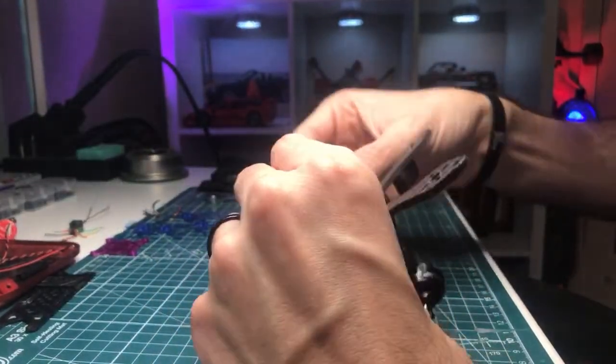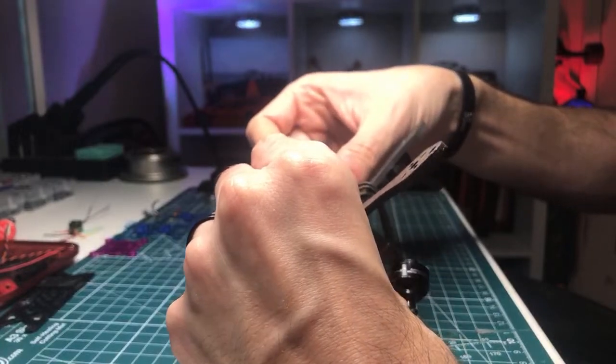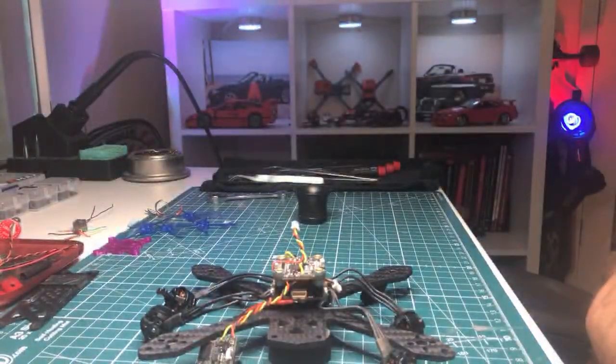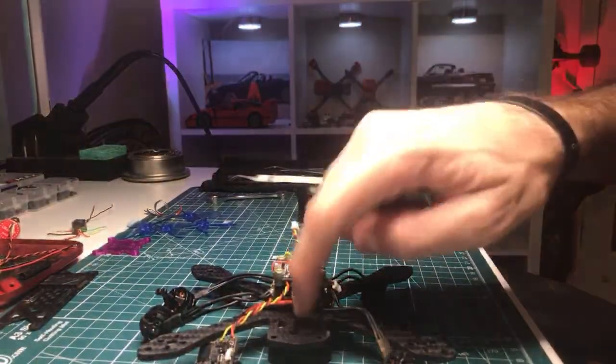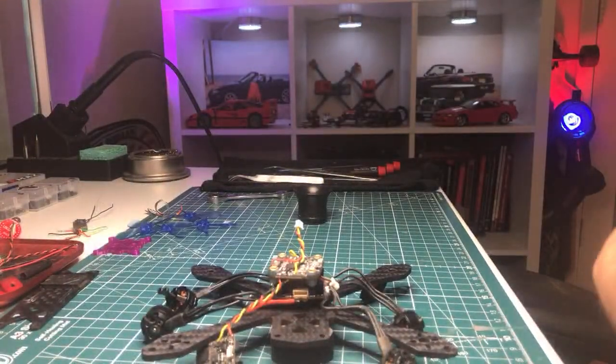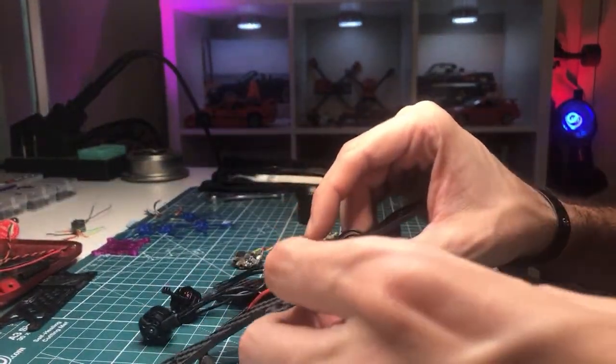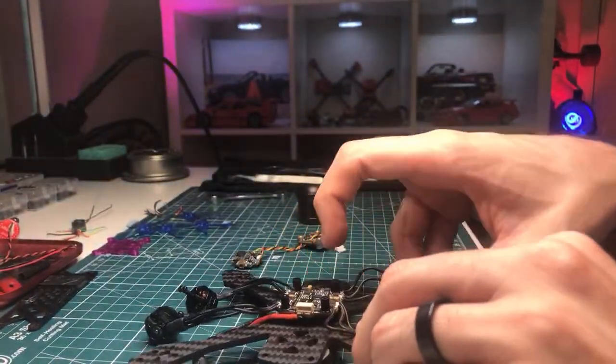Let me see. I might have done this because there's just no problem. Now, see, it's not going to clear a 20 millimeter standoff, so I need to get this stack height down. All right, so that totally derails getting anything done with this. I thought that I thought this out, the way that I put this ESC in here, but apparently I didn't, because having these 5 mil female-to-female standoffs...